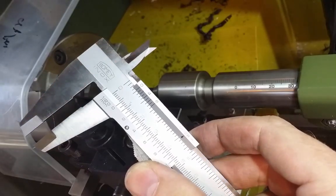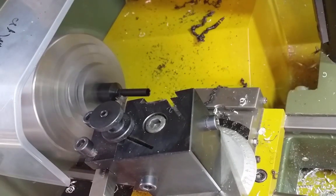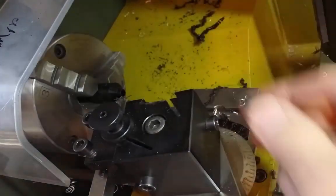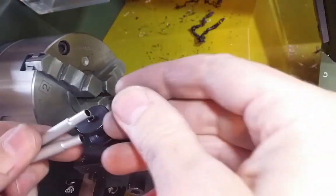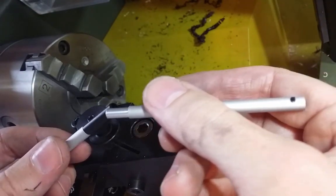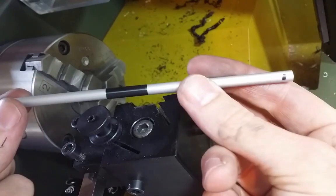6 millimeter on the outside. That will fit inside the boom now. So let's cut this off now. That's it. Let's try it. So here you see it fits on these two elements. So this unit will make the dipole antenna then, right? Time to connect the cable now.